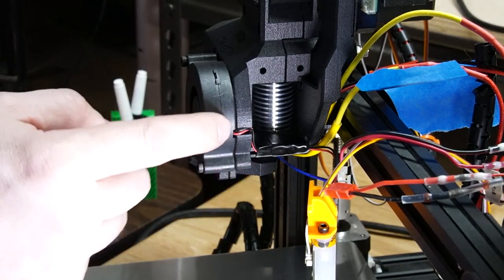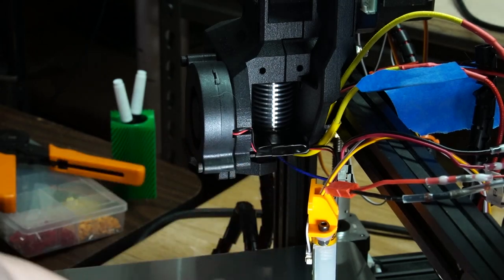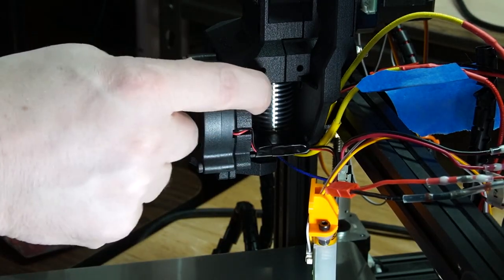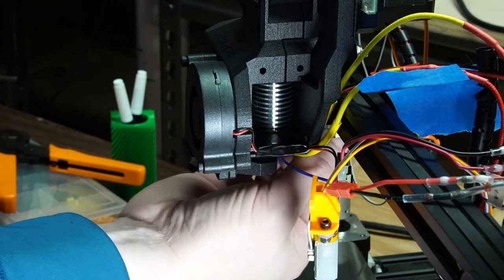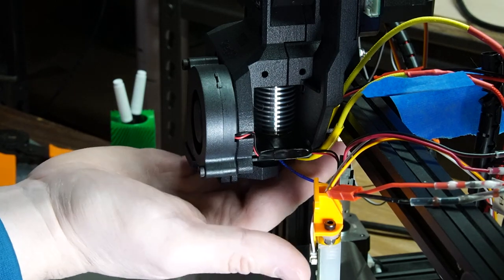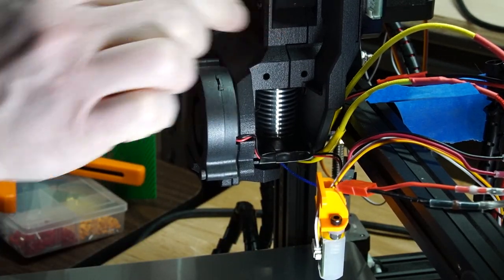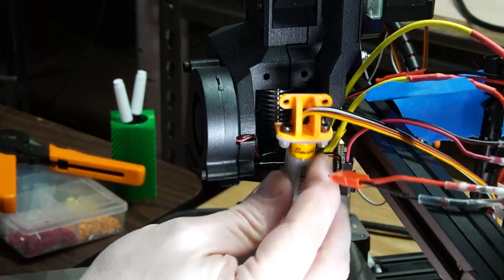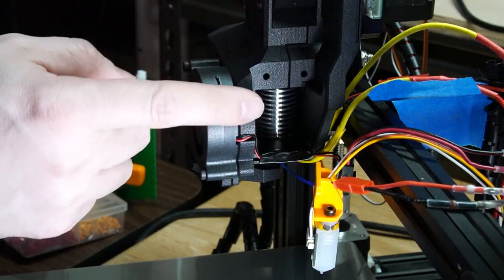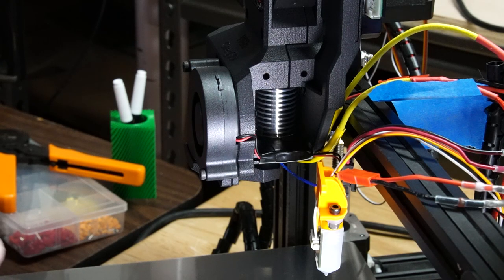A couple of updates: the wires going into this little opening can easily come back out because they're so thin at 26 gauge, so I used electrical tape to cover it up. Also, no more wiggle — I loosened up the wheel and made sure it was centered in the V-slot for the extrusion, then used the eccentric nut to get it properly tightened. This thing is solid — the whole printer moves when I tug on it. The BL Touch is wired up and ready to go. It's just a matter of cleaning up these wires and getting rid of the old extruder, and step by step we're getting there.